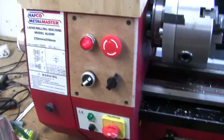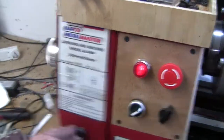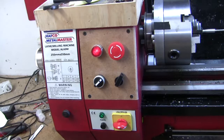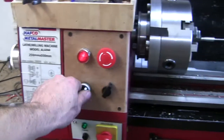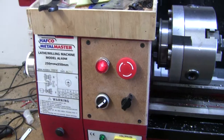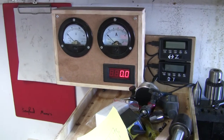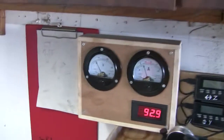All the safety switches on the motor cover have been disabled, mainly because I couldn't be bothered wiring them in. But I'm pretty conscious about that — whenever I open that cover I'll be shutting off main power, so I'm not overly fussed. You can see the tacho light up. Starting it running, you can see all the gauges pop to life.